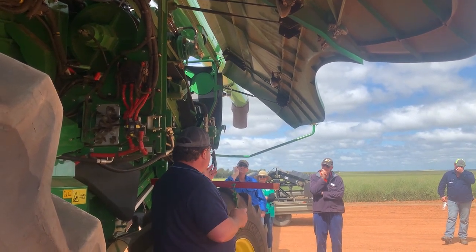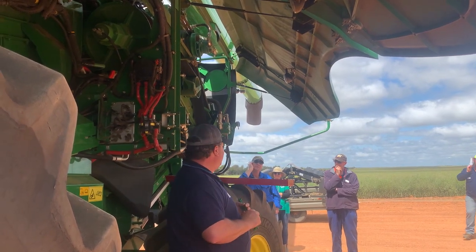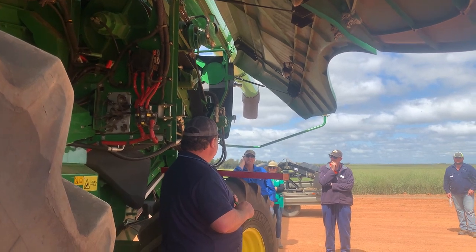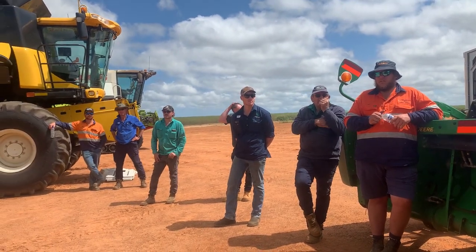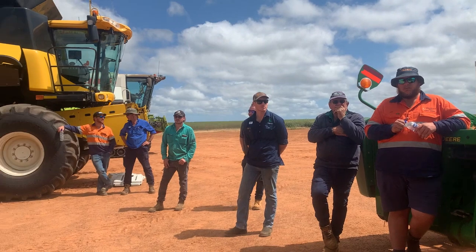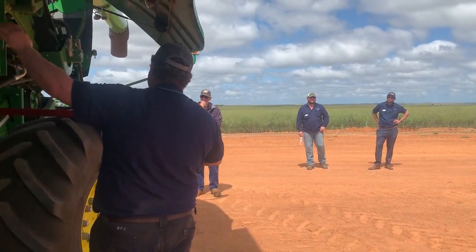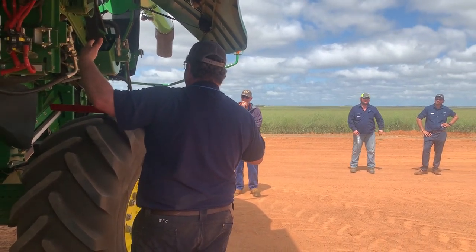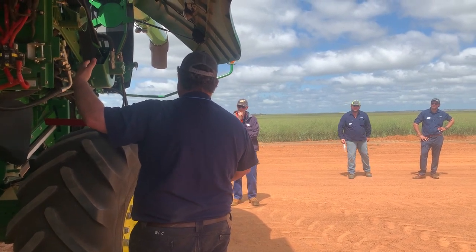Well, I'm glad that you said you see grain loss on the left, so that's our theory. Oh, well, you're right. We might be just looking at it the wrong way completely. Yeah. There's so many of these things turn out to be arse about, don't they? Yeah. Like, so many of them. Taking grain from the left because you think you've got too much air. And that's exactly what I said at the start there. I've taken grates out on the right hand side and cut it off to put it in there, and then the very next day we've realised we're not losing it on the right, we're losing it on the left.